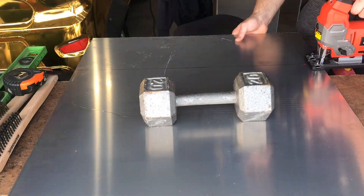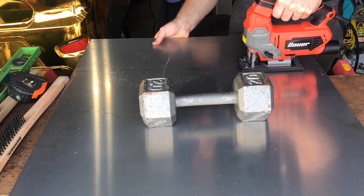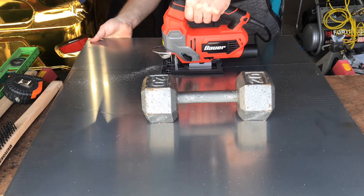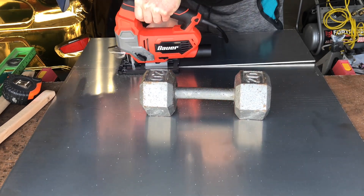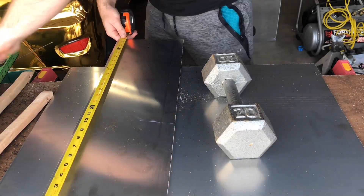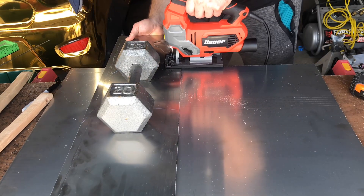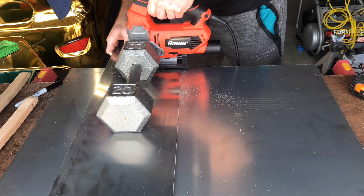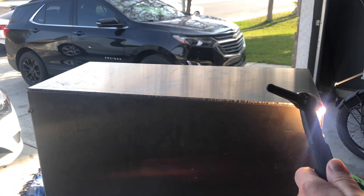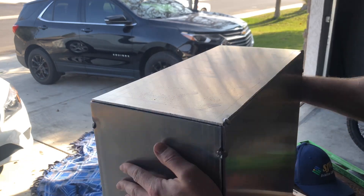We're starting off by cutting out some aluminum sheets — this is 6061 alloy, an eighth of an inch thick. This is going to be the box that the battery is housed in. If you missed the build of that battery, feel free to check out the video on my channel or the Injust channel. It was designed intentionally to be quite form-fitting, so I'm cutting it not much larger than the dimensions of the battery. This is my first attempt at TIG welding — I'm just tacking up each of the edges and making sure it's square.